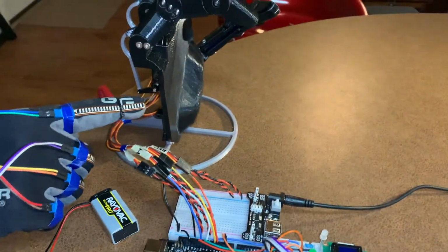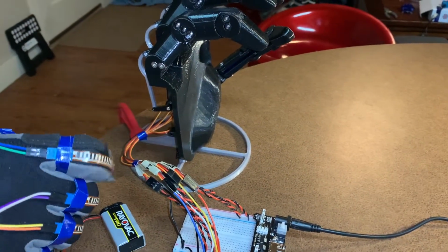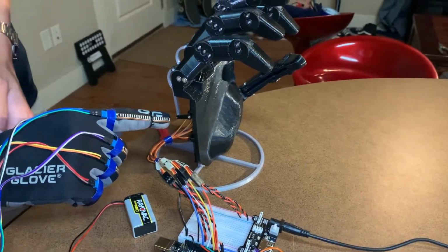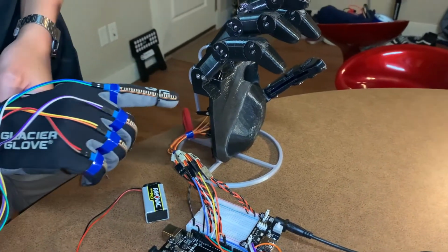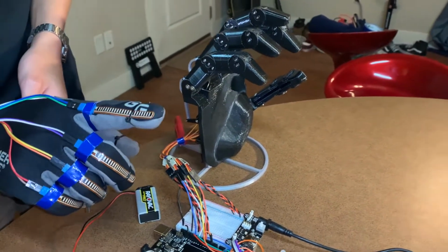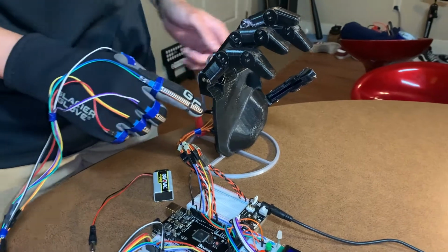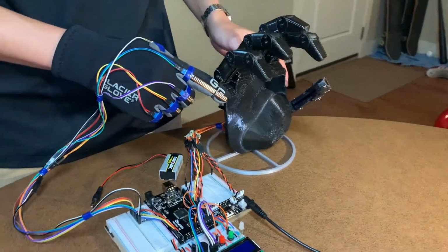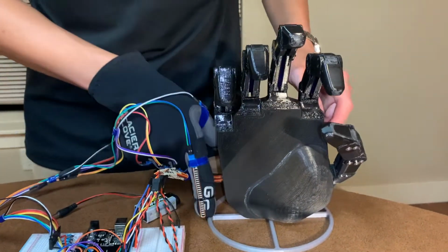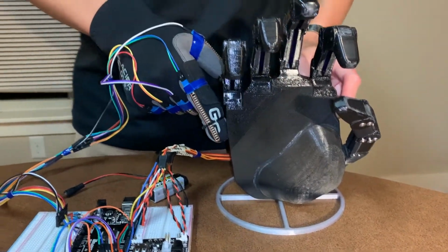And so then, depending on the relative bend of my finger, the servo arm will move and translate its motion into the finger using a total of 3 4-bar linkages per finger to make the finger either extend or contract. In total, there are 15 4-bar linkages in the robotic hand section. The robotic hand, as well as the base here, are printed from PLA.